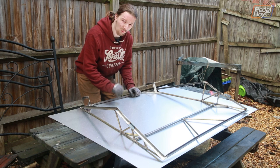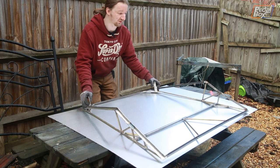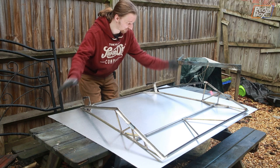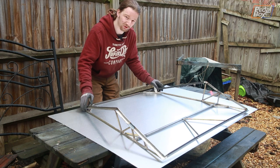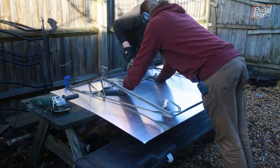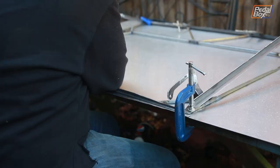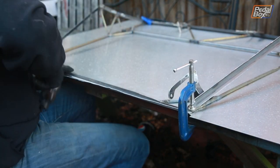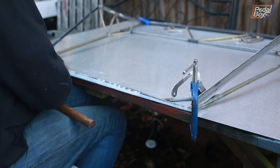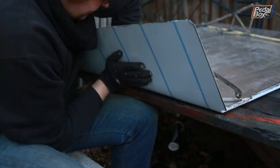We've got that big sheet of aluminium measured up. We really don't want to waste another 40-pound piece, so this time we've measured it three times, checked it against the frame on both sides, and still given ourselves an extra few inches just in case. We spent a long time working out how to attach the sheet onto the framework — the flanges that it wraps around aren't big enough to put fastenings through without them being visible on the outside. So we're folding them over gradually, bending it around and tightening across the top of the skin before folding the sides down, then putting pop rivets through the edges.